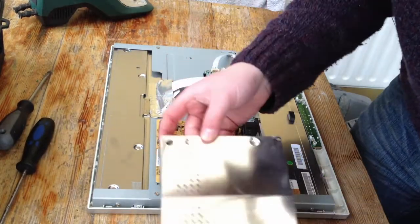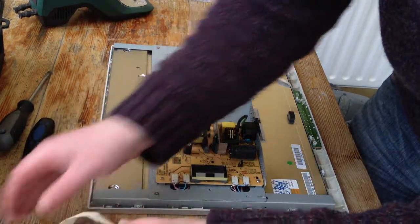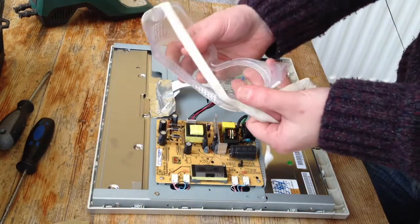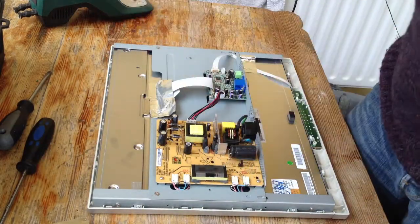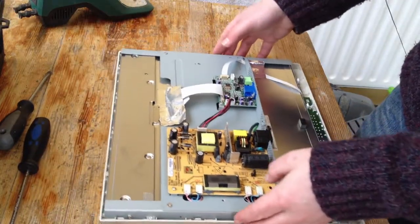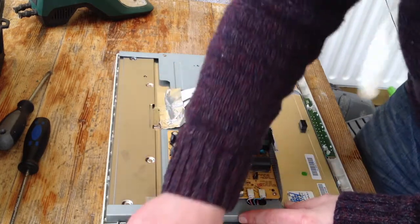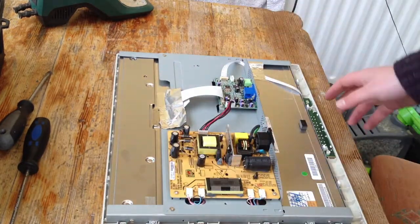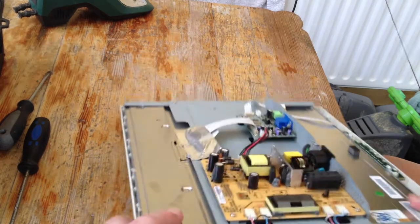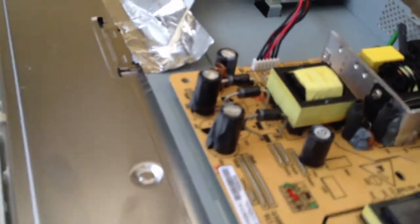What we're looking for — and it won't be the same on all of them — is something that happens on a substantial number of LCD monitors and TVs: the electrolytic capacitors on the power supply have a habit of failing. There was a bad compound in them and they just don't last with the heating and cooling. They bulge and tend to vent at the top.